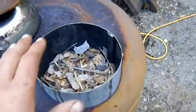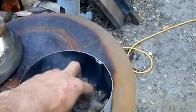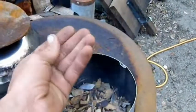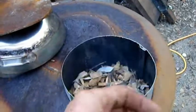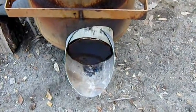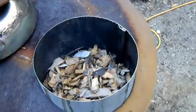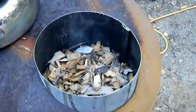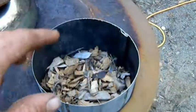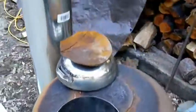Here's the feed tube cartridge. I've got it loaded full of chips that are pretty wet. So this is partly some smoke and mostly steam from the chips heating up and drying out. I discovered that if I block off most of the air down here, it forces it to draw downdraft style through the chips — and I don't have to put a cover on this. It actually works really well. So I packed this all the way up and I'm going to see how long it takes to burn a full load of chips.